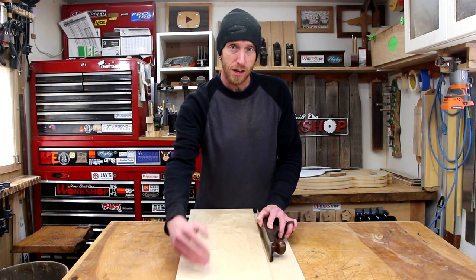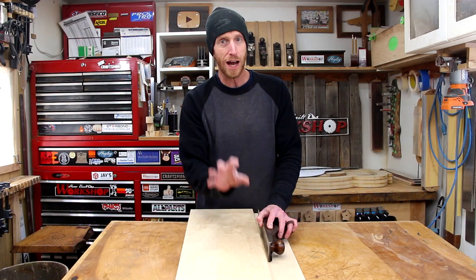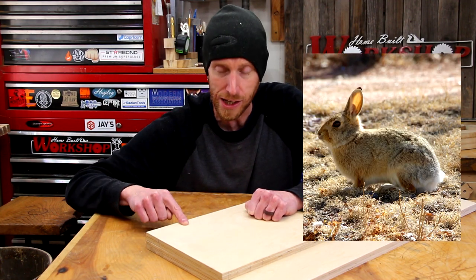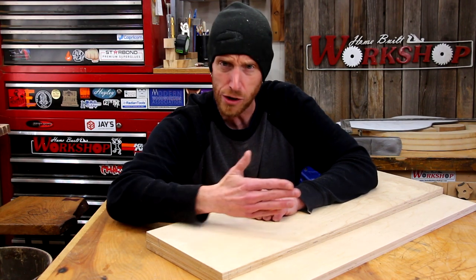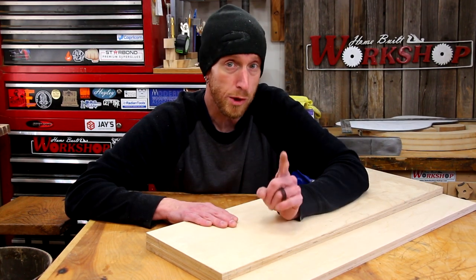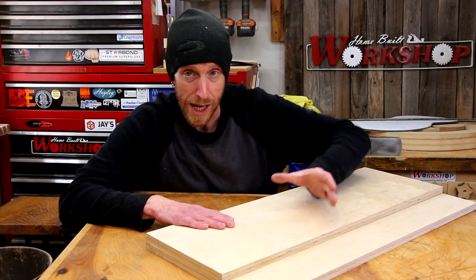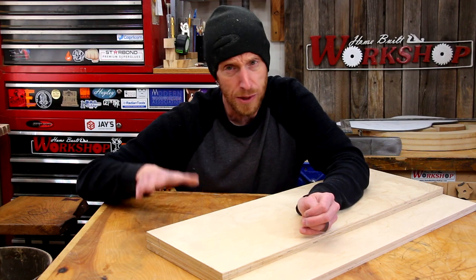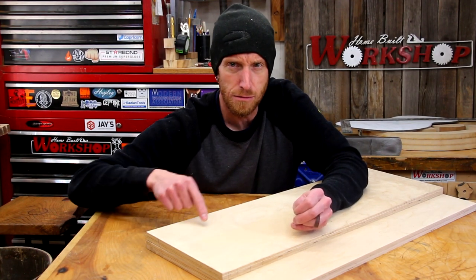I want to go just a little bit further than that. I want to have a fence at the end, but I also want the option to change that up down the road — maybe a 45-degree fence or something different. I want to create a small rabbet that'll allow me to insert a block of wood that could be the fence, or maybe attach it to some angled piece for 45-degree miters, making this more versatile than just shooting 90-degree angles. Also, when putting together your shooting board, pay attention to which hand you are. Mine's going to look backwards because I'm a lefty — I'll have the ledge on the left. If you're right-handed, you'll probably want the ledge on the right-hand side.